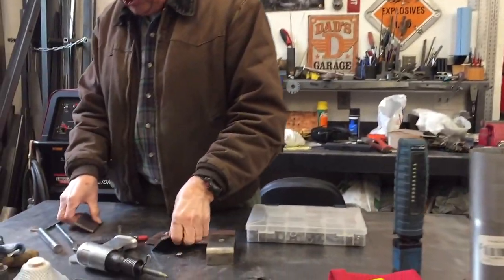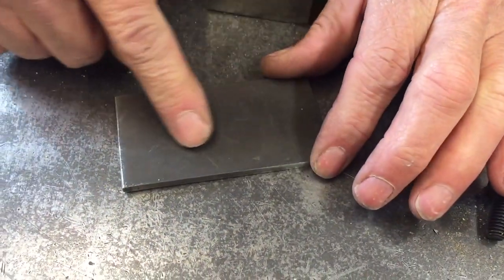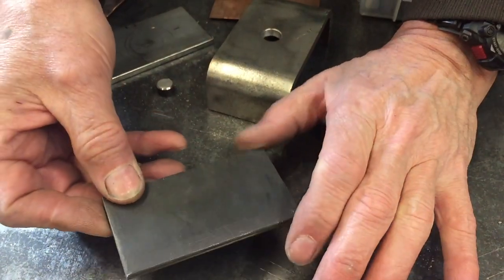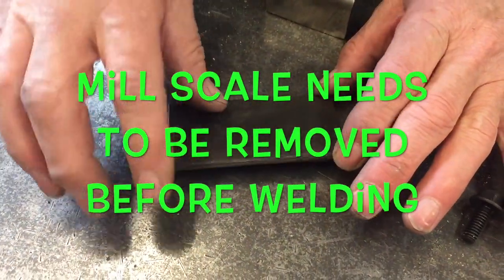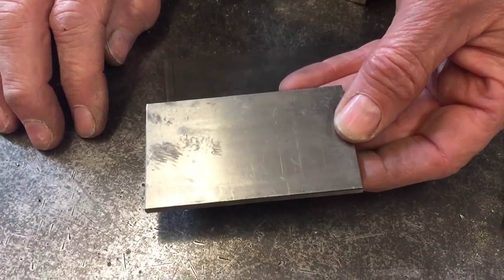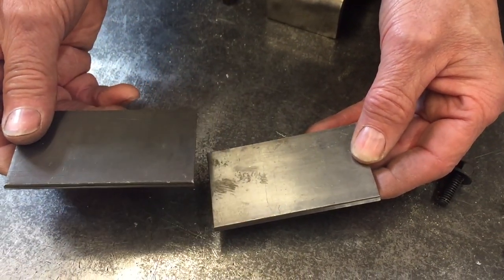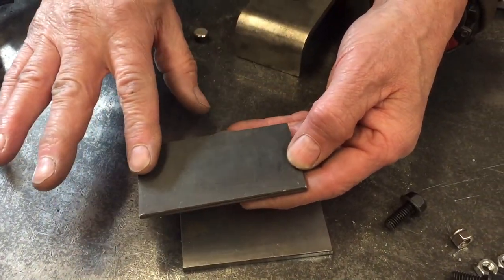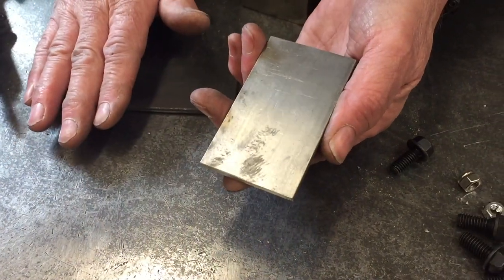When you're getting your steel, this piece here is hot rolled steel and it has this dark gray mill scale on it. This stuff is super hard — in fact, mill scale is harder than the base metal. You'll want to grind this off before welding, but rather than go to all that work, when you go to the steel place, tell them you want pickled and oiled. What they do is immerse the hot rolled sheet steel in an acid solution that removes all the impurities and mill scale, and you end up with a nice clean piece of steel.